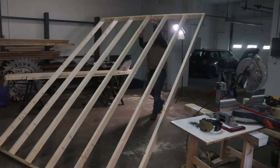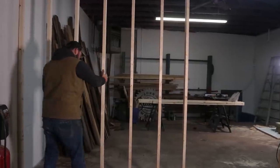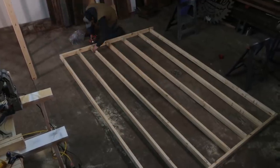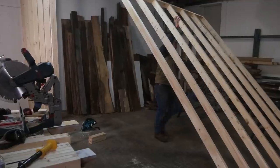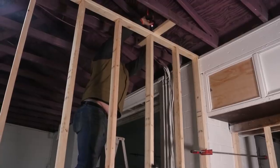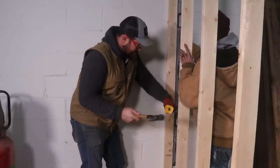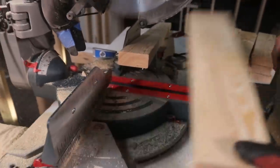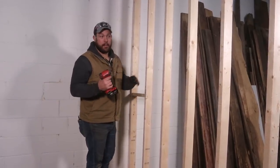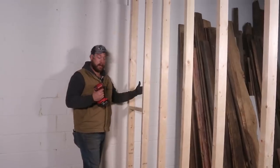And up we go. Because these walls are so tall, we're going to block them out at four feet and at eight feet — that'll help prevent racking and strengthen it up. We're also going to put two swinging doors on here, which will put a lot of tension on the doors themselves, so in order to keep them nice and solid we're going to add some blocking in here. What I did was chalk a line across each board the whole way across both sides, and then I'll just put one block above and one below — that gives you access to screw them in.